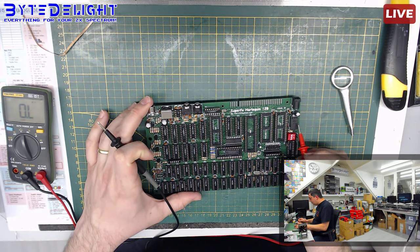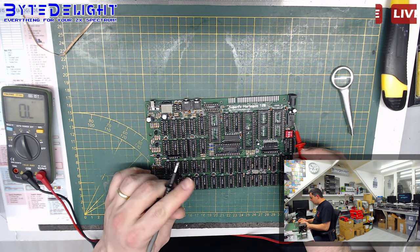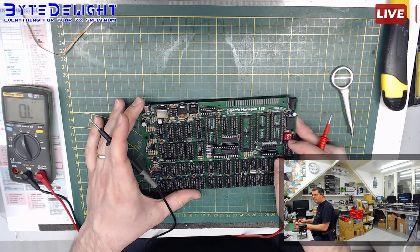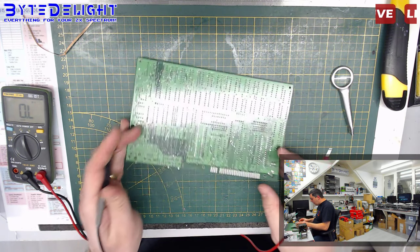And I already also replaced the voltage regulator. I tested this one from the board separately. It was fine. And I also used the Traco power regulator to check if the regulator might be bad or something, but that wasn't the case. So when I put on the Traco power regulator, we still didn't get 5 volts. So what is wrong here? I have absolutely no idea.